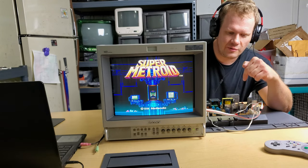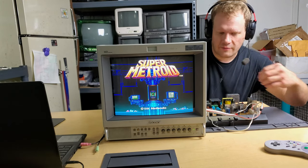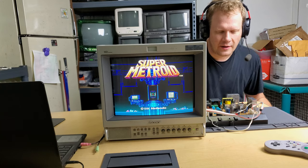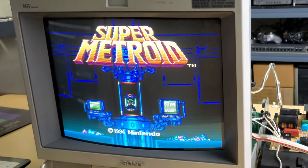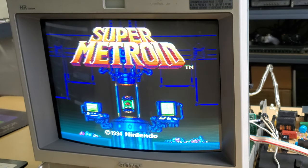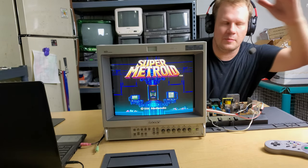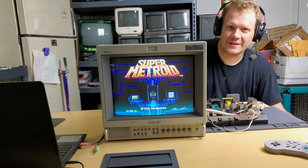So just let that be a key takeaway on this power supply — that's how you need to troubleshoot it. If you're not getting power into your PVM, unplug everything, get your power supply out, and probe your board after sending a little power back into it to check if you're getting the right voltages. If you have a 15-volt power problem, it's more likely one of the larger ICs with seven or eight legs. There's also a possibility it's the capacitors, but I've been told by Savon Pat that more often than not it's the 5-volt regulators and other regulators on the board that fail. That's an easy and pretty cheap fix — and now we've got a working PVM. See you next time with some more retro content.